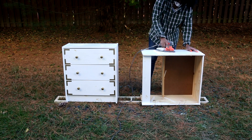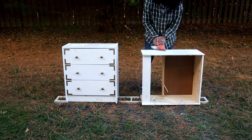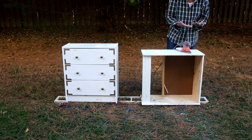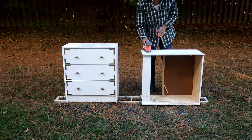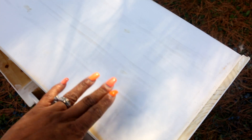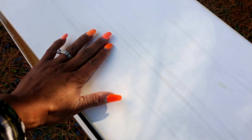I'm using the Black & Decker mouse sander. I have the link to this in the description box. This part of the process does take long and my arms were on fire when I was done and I took a few breaks in between. Here's a close-up of what the dresser looks like after it's been sanded down. You can see that the glossy top coat has been sanded off and some of that natural wood color is coming through again. I'm not going to sand this down completely because it is primer and most of all my goal was just to get rid of those paint brush strokes.